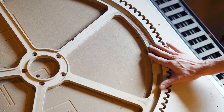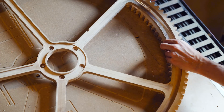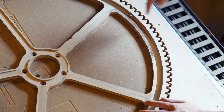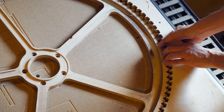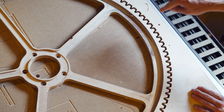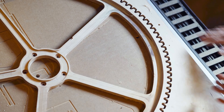We made two big mistakes when we cut this first gear. You see this hole where I put my fingers through? That should not be there. What happened was that the down-cutting spiral bit threw wood chips under the plywood and lifted the whole plywood up, resulting in a too-deep cut. That was because we didn't clamp the plywood to the work table strongly enough — so the first fix is to clamp it down.